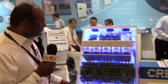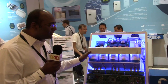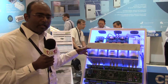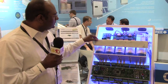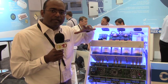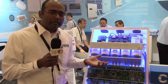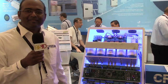To summarize, the advantages of using silicon carbide in this application are the size and weight of the system. This system weighs roughly 40 percent that of a comparable silicon-based system. Switching at high frequency enables us to maintain the small size and weight while keeping the efficiency of the entire system comparable to existing silicon-based systems. One of these boxes can replace two of the silicon boxes. Thank you.